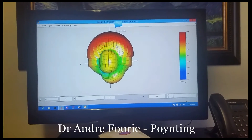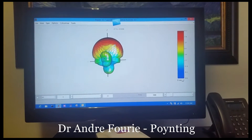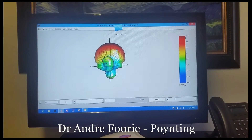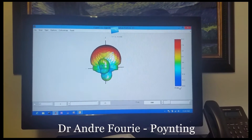Skipping forward in its frequency range to 1900 MHz, notice that the gain has gone from about 10.5 up to 11.2 dBi. This is about mid-band of what used to be the top GSM bands, now often used for LTE and other data communications.